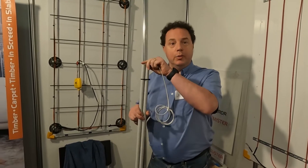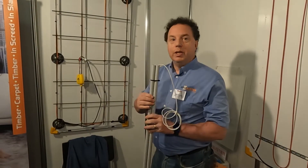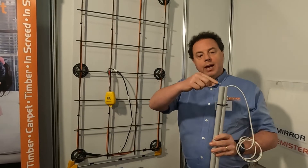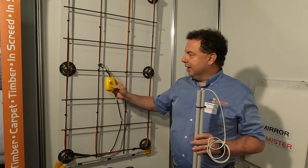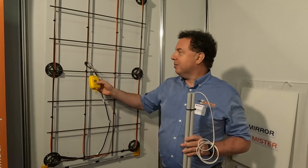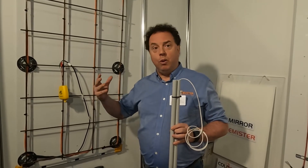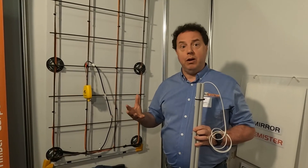One of the great things about floor heating is it's so simple to install. Firstly, your electrician will put in two conduits like this in the wall, then we arrive to do the installation. First thing we do is put the cold tail — the black part at the end of each heater — through one conduit, have it sticking out, and we attach our monitor to the end. We turn the monitor on; if the light is showing and no siren, it's working fine. If anyone does a break while we're installing or while the flooring is being installed, the siren goes off so you know a repair needs to be made. It's very rare, but it's a fail-safe.